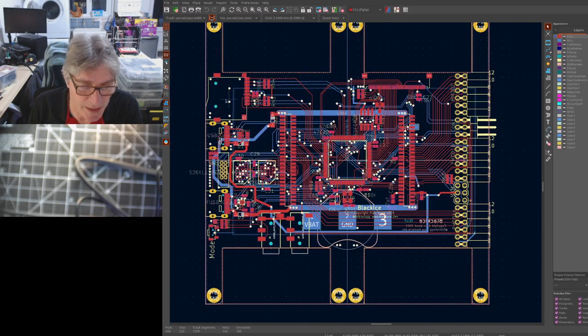Quick tour. So we've got the SD card, the MMC SD card here. We have the normal programming USB/virtual COM port. Then we have the programming port here, debug port for the STM32. And then we have the USB for power delivery here, with the power delivery controller, and that delivers higher voltages to the tiles, or programmable voltage to the tiles up to 20 volts. The mode switch here can be used as DFU, so when you're starting up you can put it into DFU mode just like it was on BlackIce, really. That's not changed. We can also have a mode when we're going along, so we can have a backward compatible mode that makes it like BlackIce if we wish.